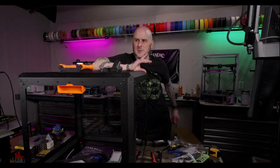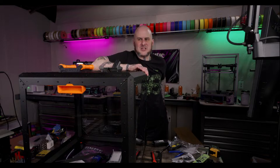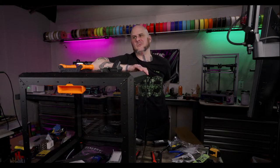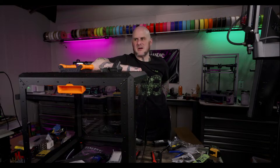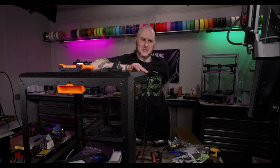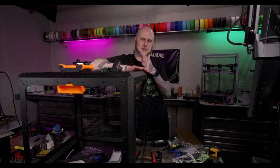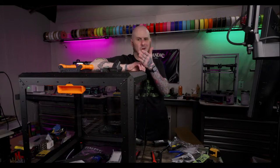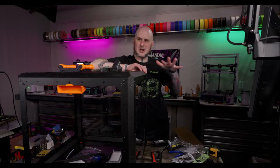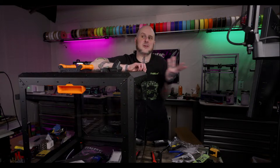Any tips for getting a 0.8 millimeter nozzle tuned on the Neptune 3 Max? I mean, I have my tuning guide. You can apply that to the 0.8 millimeter nozzle. But honestly, it's just nozzle width you need to worry about, and just adjust your nozzle width to what you need. I usually say 5 to 10% over nozzle diameter is what your nozzle width should be. So between 0.8 and 0.85 for various things. Try setting it all to 0.85, print something and see if it's rough on the top layer, then dial the top layer down to 0.8.